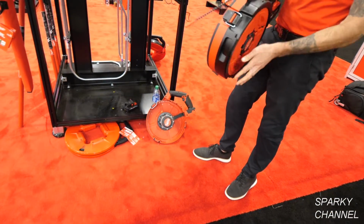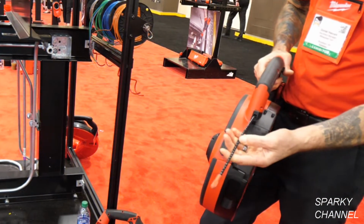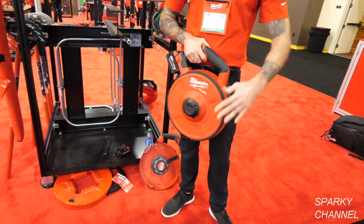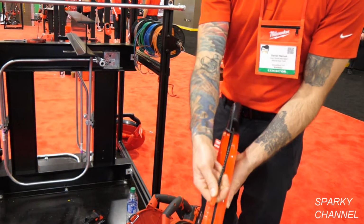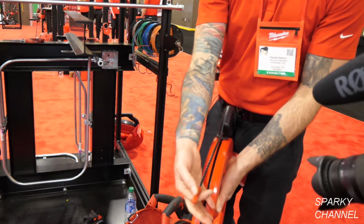Is the tip on that conductive or non-conductive? This is a truly non-conductive. This is our premium polyester triple strand. So it's the 100, the truly non-conductive drum. This is non-conductive as well. These actually share the same premium polyester triple strand that we use in our hand tool fish tapes as well.